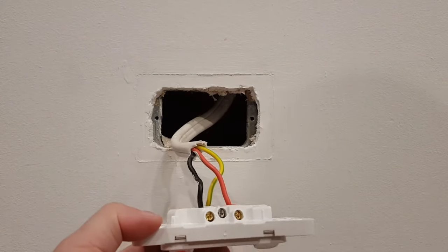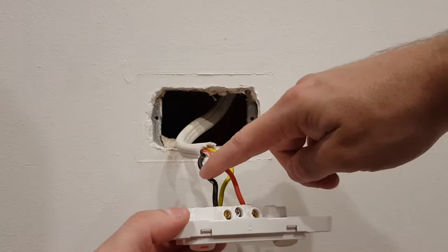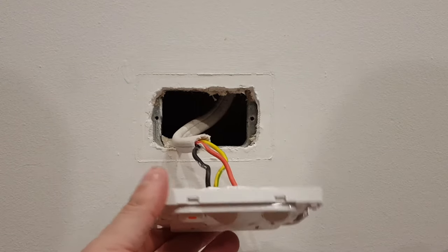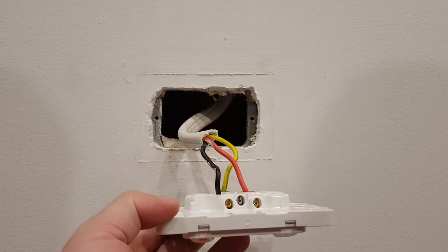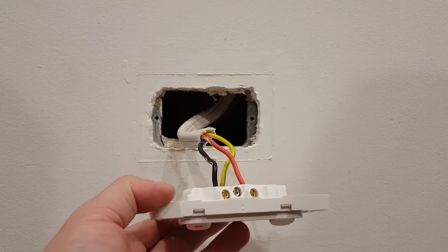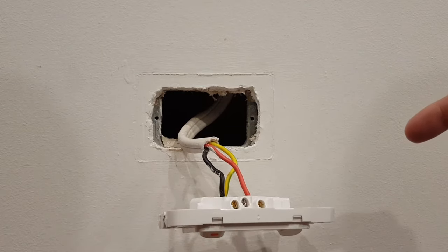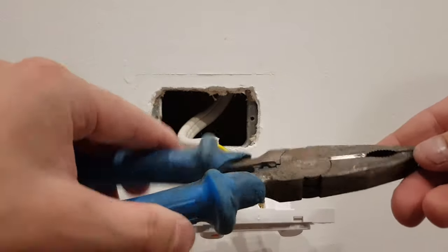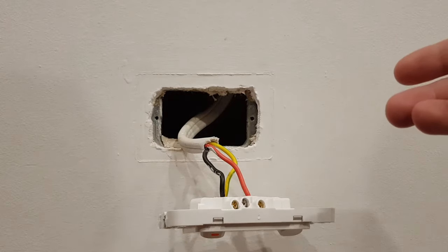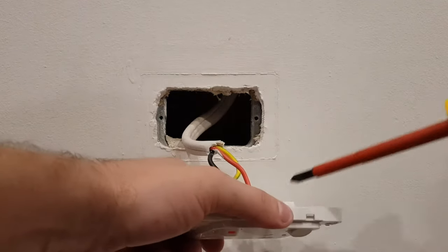At this power point I've only got one cable — one red, black, and green/green-yellow. If you have more than one cable, more than likely they're all in this power point twisted together. You just want to undo all three terminals, remove the cables, and give them a slight twist with your pliers just to make sure they're nice and tight. If they're not, you may have to strip them and re-twist them. Disconnect the wires from your power point.